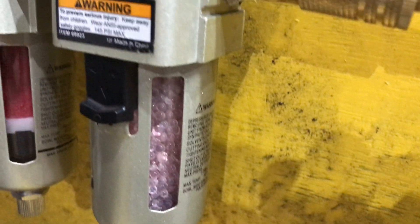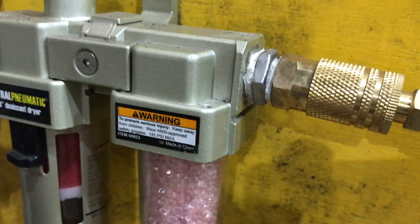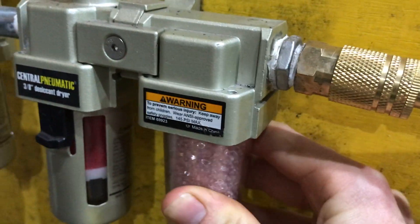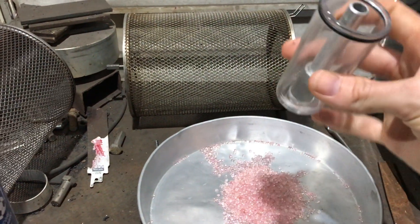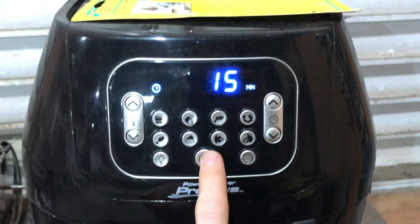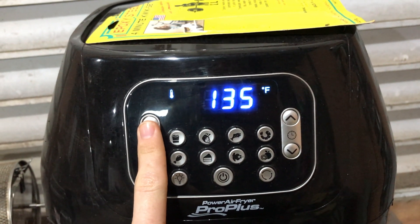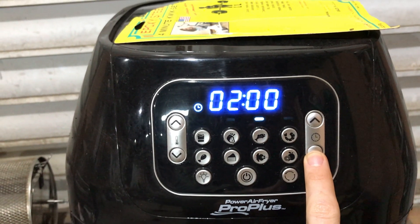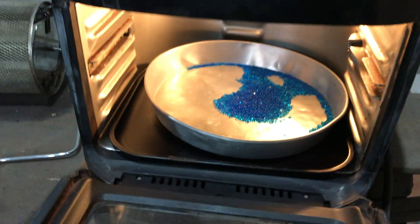After running air through it for most of the day, you can see the desiccant has absorbed quite a bit of moisture and it's ready to be dried out. For drying the desiccant, I'm using a little tin pie plate and putting the desiccant into the air fryer, which also works as a dehydrator. Set it to 135°F — don't go over 140°F with desiccant. It takes about an hour and a half. After that time you can see it's all nicely dried out and back to blue.